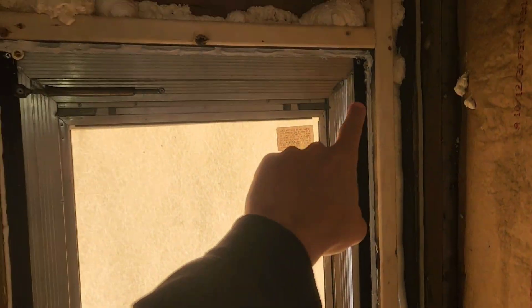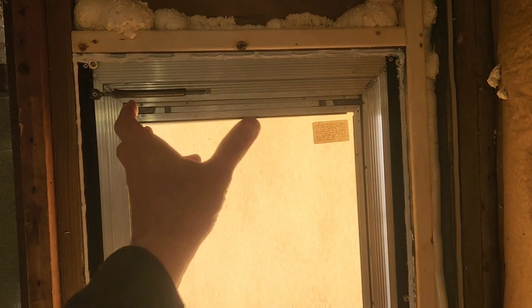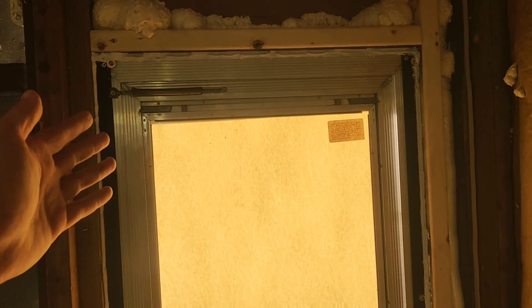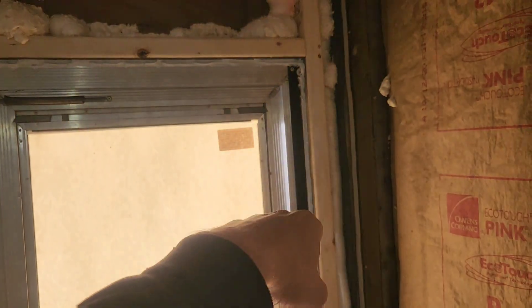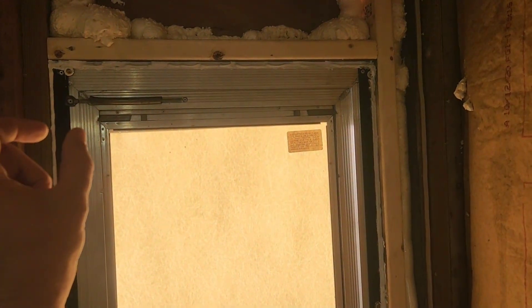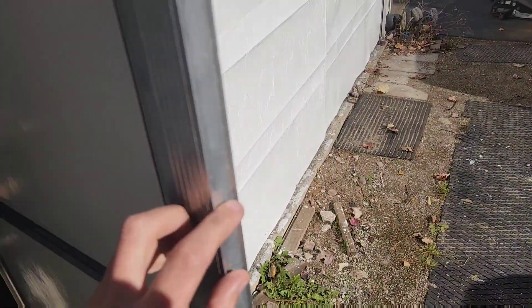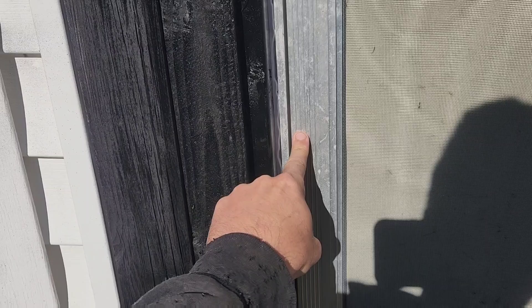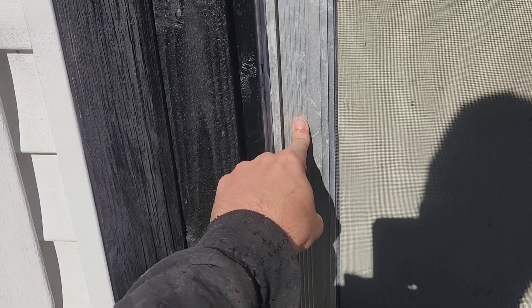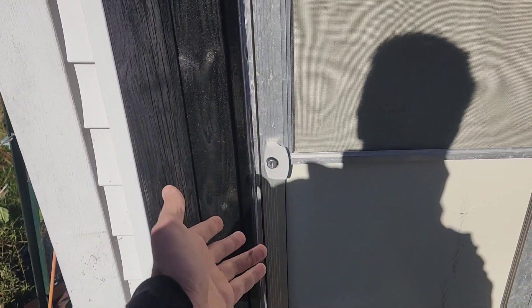This door is in its own little 1.5-inch box. The door floats in its own welded-together box. So rather than fight with that, what I did was I made an opening here with 2x4s that is a half an inch extra on all sides. We've got a press lip right here, so when this closes and the wind blows against it, it seals it with the wind pressure. That's why the door is going the wrong direction for how I would like to have it open.